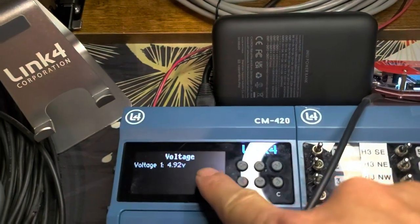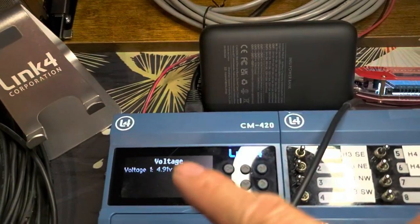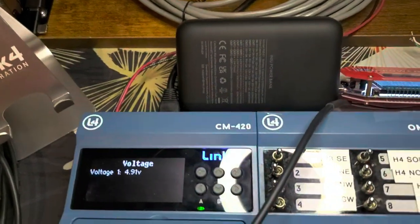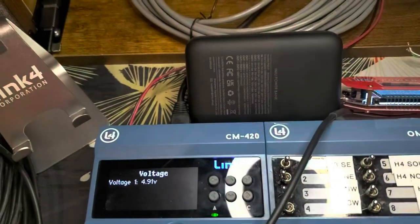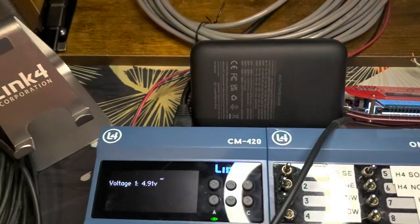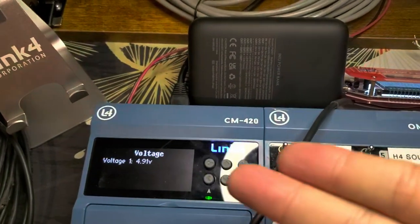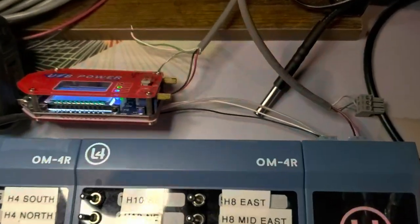It could be a sensor, or a voltage from another analog output. There are many devices or sensors that have an analog output that's good to measure. And sometimes you can debug the system just using the voltmeter, because if you have one of the analog input modules, you have 5 inputs up here.